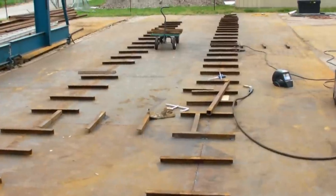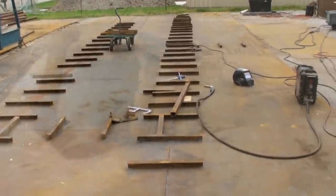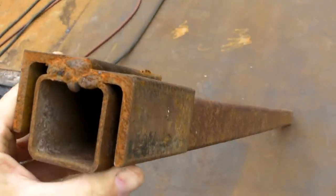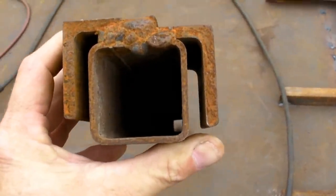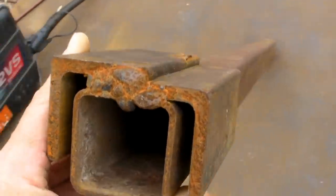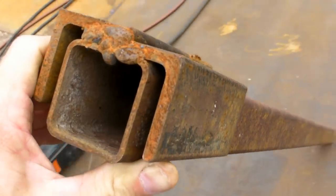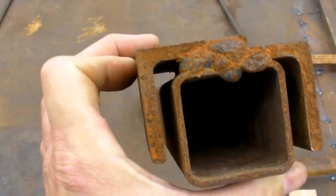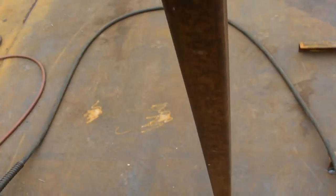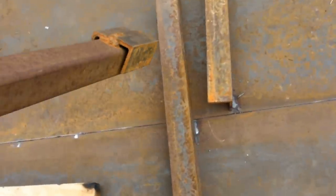I made a few tools to help me with this and it turns out I only used one of them. Let me show you that one tool. It's a five-foot long piece of square tubing, about an eighth-inch thick wall, and it's got two pieces of angle about five or six inches long welded on top so that they make slots on both sides. That slot is a little bit more than a quarter inch because we're using quarter-inch material for our Strong Backs.